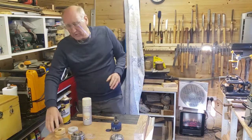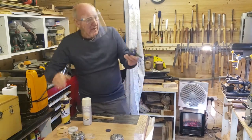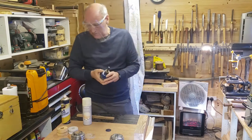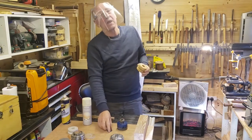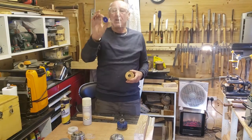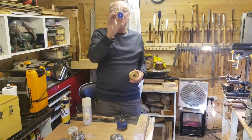What I do when I'm making the small hats: first, I put this on the pillar drill without the actual drill itself, and drill out the wood into circles like that there. Then this particular hat will have an acrylic band, and I use a smaller cutter for the acrylic band so that I'm not using a big one and I save material that way.